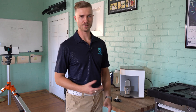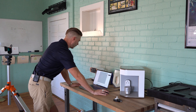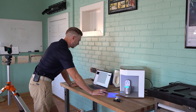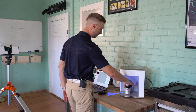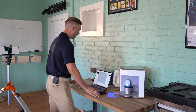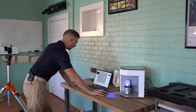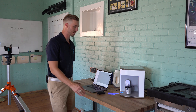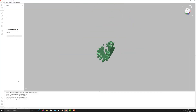Let's take a look at what it's like using the Artec Micro. The first thing we're going to do is open up our scan tab, select scan with Artec Micro, and we can see a blue light comes on. We'll go ahead and put our part in, and now that we have our part in the machine we can adjust our brightness, choose our default scanning path, and then press scan. The system will start moving the object accordingly and generate a full 3D scan file for us.